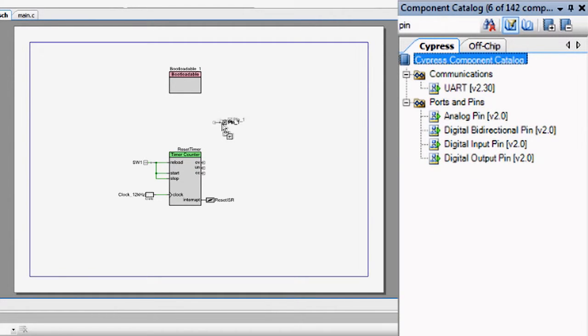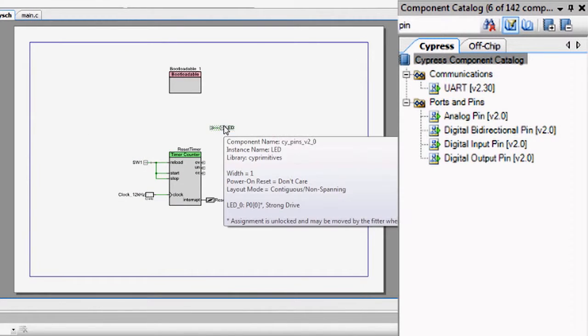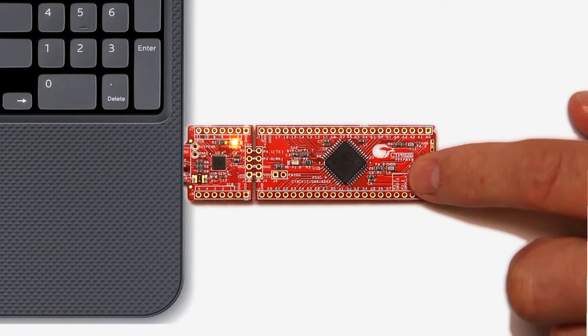There's one last thing to mention. This design does not in any way mean you can't use the button for other things. One of the great things about PSoC is the hardware can be wired wherever it is you want to use it. There's only one switch on the kit, so dedicating it to this one function would really just be wasteful. This is a PSoC, so you can route the SW1 input straight to the blue LED on P16 while still driving the timer. The switch is now driving the LED as well as controlling the reset timer.